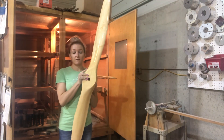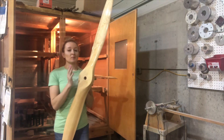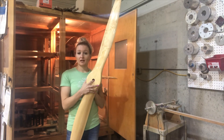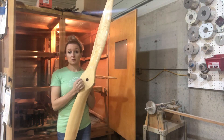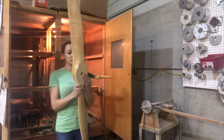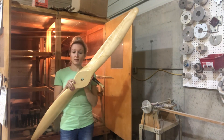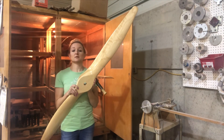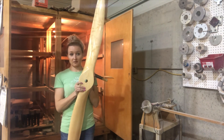This prop is for a full VW engine. I haven't drilled the bolt pattern on it yet, but it is a 60 by 28. It's going on a Signet airplane with a 2180 full VW engine. For a full size VW, we make a 60 roughly by 28, or a 62 by 26 sometimes — it just depends. But this is for a full size VW.